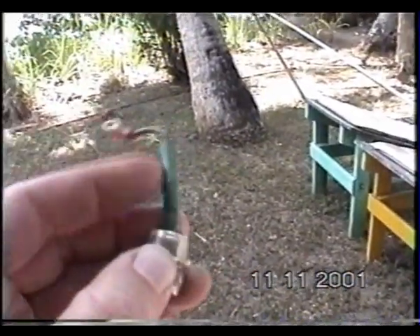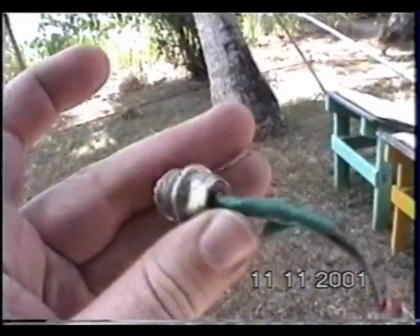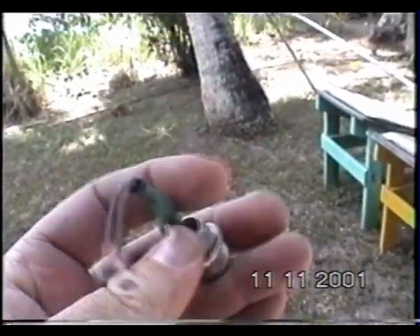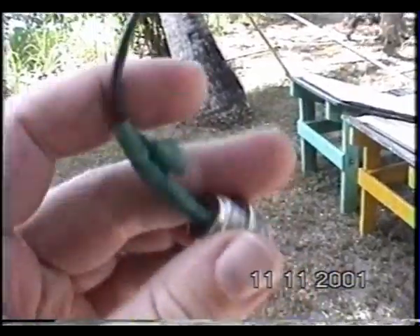The only problem we've come across with this Yagi is one slight little mishap, which always happens. With the siding line — actually I don't need the siding line now — it's this connector here. That wire always comes off. You can solder it so much, but when it's in the pole and all the other bits of aluminium are hitting inside the big piece of conduit we bring along, it always seems to snap off. But I do bring a spare.